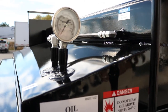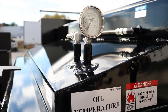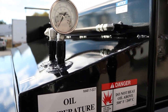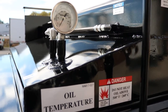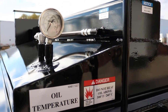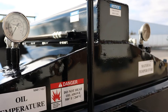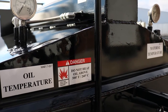One of the most important things in regards to safety and operation of the unit is the heat transfer oil. The heat transfer oil in this unit is preset to 500°F and you don't need to go any higher. It's really important that the vent lines on this unit are checked on a regular basis to make sure they stay clear and open. Due to the constant heating and cooling cycles, condensation causes the oil to coke up — it physically turns into a solid material — and if it does that, it can plug those lines. Ultimately the machine will have nowhere to vent, and that's a very bad situation to get into.